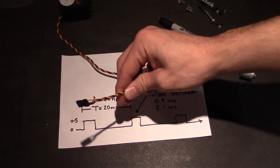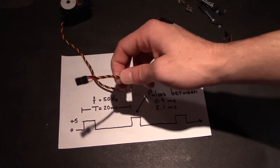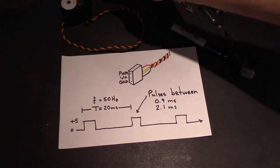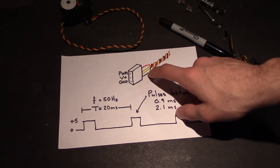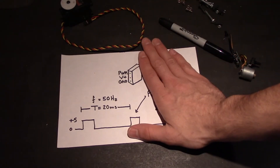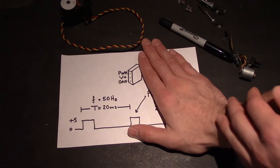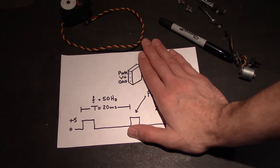Power and signal has to be given to the servo over a cable, so we've got a three-position female header, just standard 100 thou. On one side there's black, which is ground. In the center you've got the supply voltage, which will actually power the motor. And on the far side from ground — which will be yellow — is your PWM signal. That signal doesn't have to be the same voltage as your supply voltage, but it just has to be something the servo can take. Usually all that electrical stuff is included in the specifications of your servo.